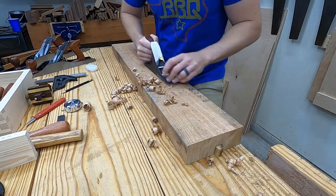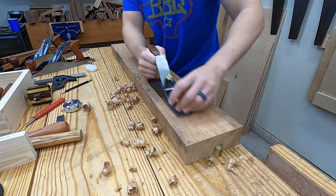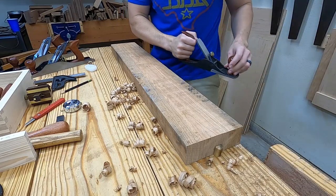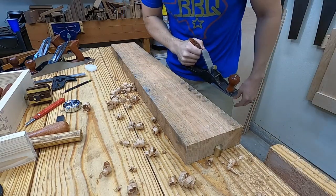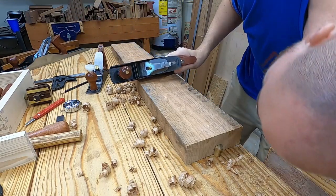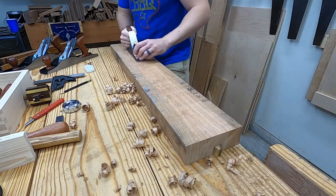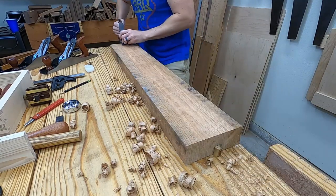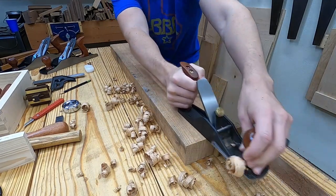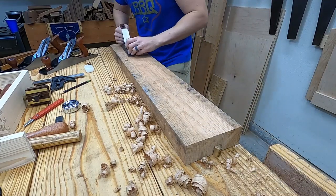After having done stock prep with only hand tools for the past 7 years in my small garage workshop, I've decided to bring back in a couple of machines to expedite the rough lumber milling process. I try to only use the scrub plane on the high spots, so in this case that means avoiding the outer edges. I tend to avoid traversing the whole face or working the entire face of the board with a scrub plane because I think it's a waste of time, energy, and wood.